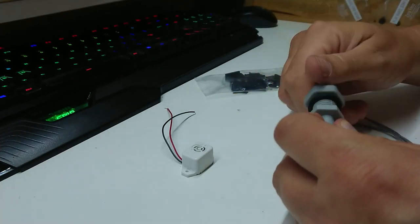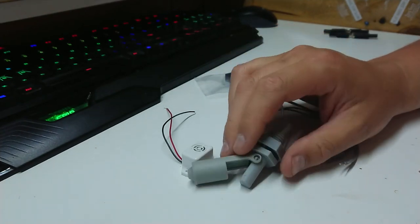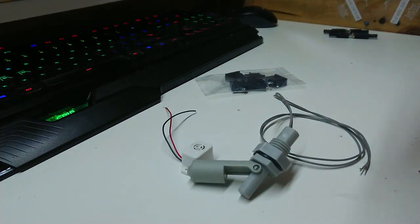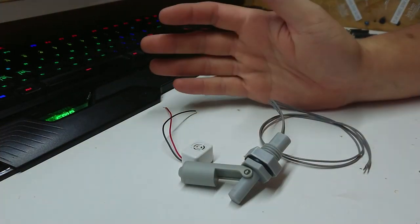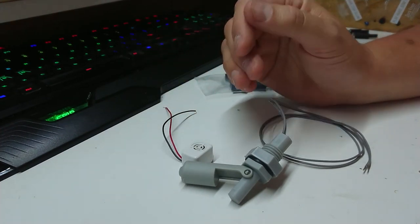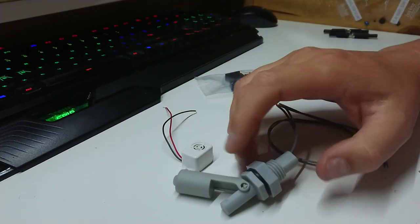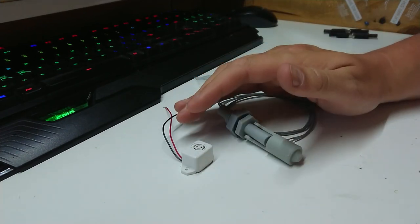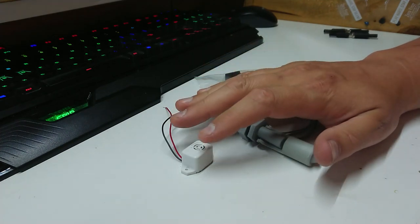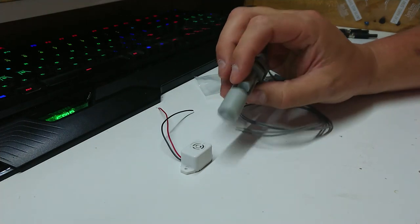Now, my bilge pump is on the right hand side, and the reason for that is my control sticks are also on the right hand side, which means there's a slight bit of a dip when I'm sitting in there on that side. Usually I'll obviously do the right thing and shift my balance when I'm in the water, but if anywhere's going to pool water, that's likely the spot where it's going to pool when I immediately enter the water. And the way flooding ships and boats work is the water tends to run to the lowest point, which of course makes that point heavier, and of course floods in with more water and so on and so on. So my bilge pump is at the lowest point that's likely to happen.